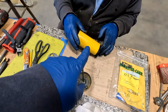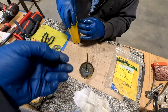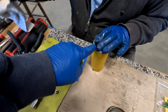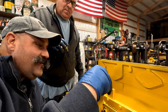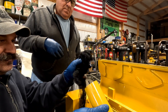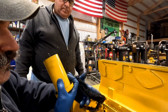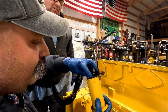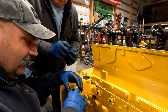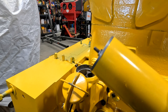The element in this filter housing is just a mesh, like copper. Then this post goes through it — it's just a breather. So when that vapor and oil vapor comes up through there, it kind of oils that mesh so dirt can stick to it and it can catch it. Basically there's an aluminum cover over each end of that cylinder. You've got to keep it centered and start feeding this coil around that stem. A little oil on our threads and we got the genie back in the bottle here. This is made to service — you just take the nut off, pull all that apart, you can clean it out in some solvent and put it back in. In the old days, they used to use gasoline.